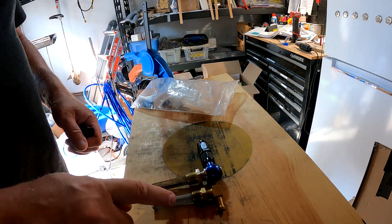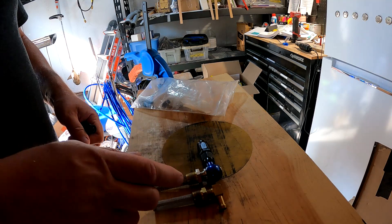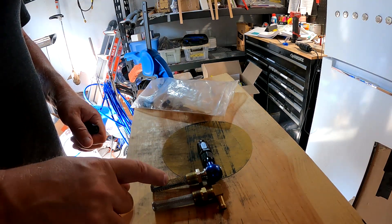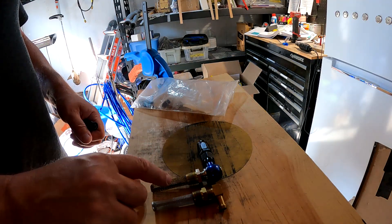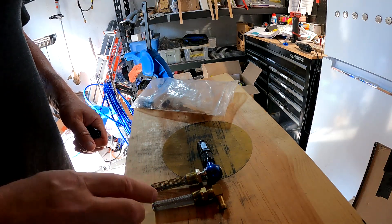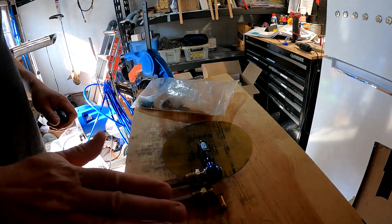You'll notice I have a coarse strainer and a fine strainer. My kit came with both sets - I have two of each. I shopped this on the forum and I was told that the coarse one would be preferable, because what you want to do is start out with catching the big stuff - I call this a gravel catcher - and then use finer and finer filters as you get closer to the engine. Makes total sense, so the fine strainers are not going to go in my plane.